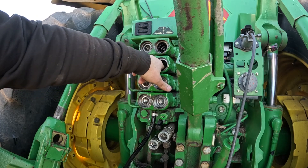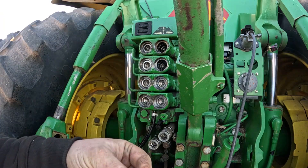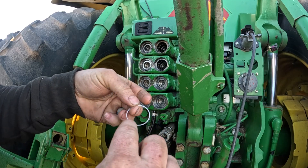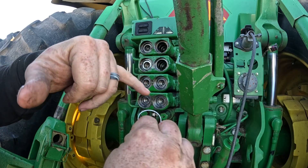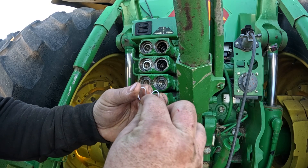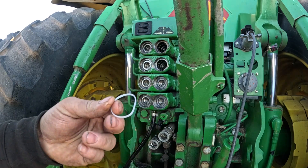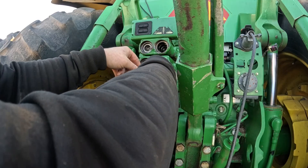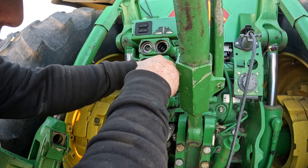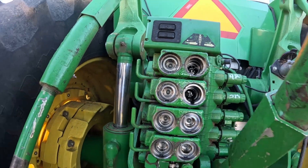Got our new o-rings — go ahead and install them. Try to get one spot in the groove and then just work your way around and roll it into the slot. Here are our new backup rings, and these are actually the hardest part. What I like to do is get them started, put my finger in there to hold the bottom side, then use a pick to shape it so you can get three quarters of the side in the groove, then take your finger and pop it up into the slot. Otherwise it's kind of a pain to get them in there — that's the easiest way I've found.